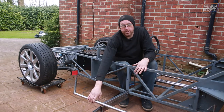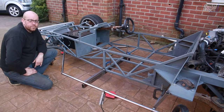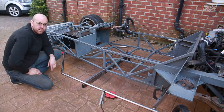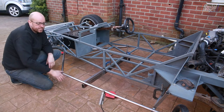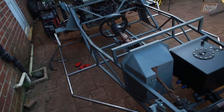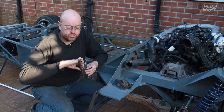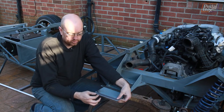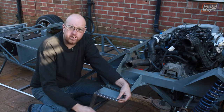With these two outriggers tacked into place, we can offer the side piece up and work out exactly what angle we need to cut at the front to line up with the rest of the chassis. We've made the slash cut so we can see how this fits properly. There's less than a millimetre of discrepancy between these two pieces, which is fantastic. We've gone round and finished the welds to make sure nothing's going to move, then tacked this in to move on to the next bit. With both sides attached, we can finish these wings. I've made these brackets out of a piece of inch box — cut in half and down to size — and these go on each side on the top. They extend it out as far as we want, up to the edge, which allows us to face up against the inside of the tube for any bodywork.